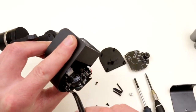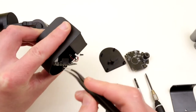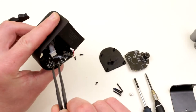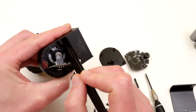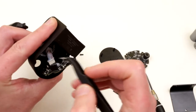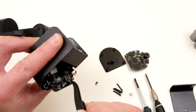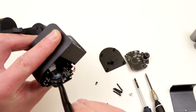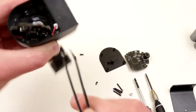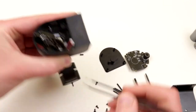There is another unpopulated connector with four pins which I assume is a JTAG or some sort of serial connector. There's a whole bunch of passives and a DuPont-style connector that goes straight down to the PCB below, where I assume the actual motor is. There are also three connections going straight to the motor. There's an active component — microchip — and I believe this is the driver for the motor. I need to pull out this board to read the exact names of these components.